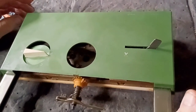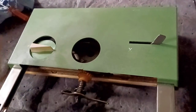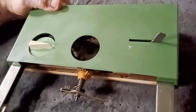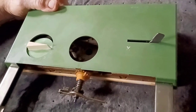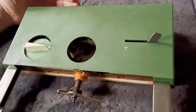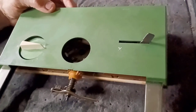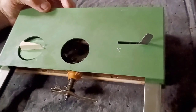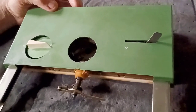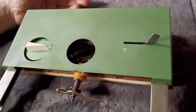Right. Whereas some people really like Ballistol, and actually I really like Ballistol, and it's more persistent to some degree than his favorite, but it does drip out. Well, and I will tell you, it's easier to get the silicon into the works. This is a finer product. Right, than anything else. By finer, I don't mean better. I mean the molecules are smaller, right? Hydrocarbon molecules are bigger than anything else. And the silicon, one molecule does the job.